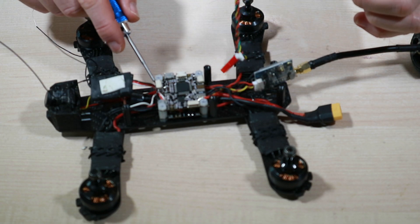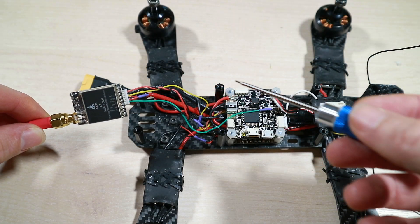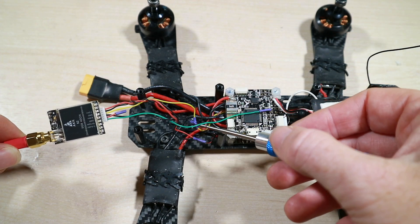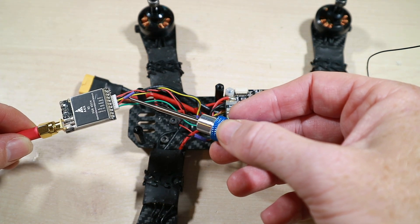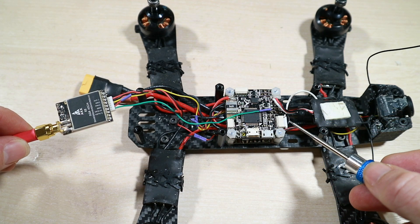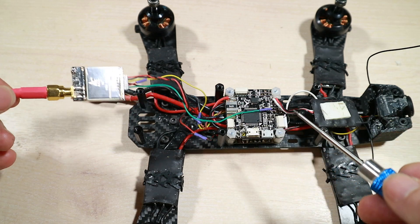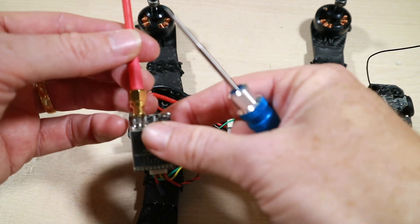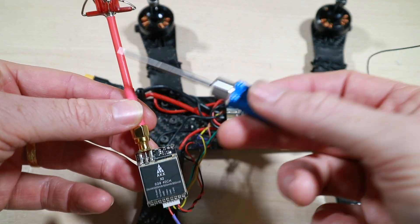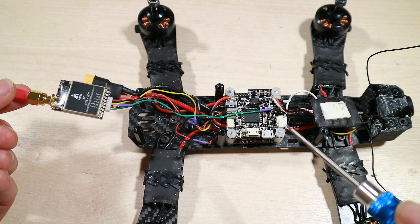I'm just going to chop this off rather than desolder it, so I can just join some wires here and find the right connector so I can solder in just the TX. We've simply joined the voltage, ground, video and video ground to the existing wires with this lovely lilac heat shrink. We've then capped off the 5 volt out to the camera we didn't need, and this green wire here is the Smart Audio which plugs into this little connector I found — there's actually six pins here, this is a five pin one but it shoves in there. It's actually RPSMA as opposed to my old one which is SMA, so I've changed over to this AKK RPSMA skew antenna. I'll power this up and make sure I get something, then make some changes in Betaflight.